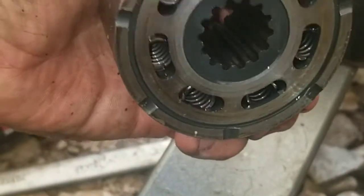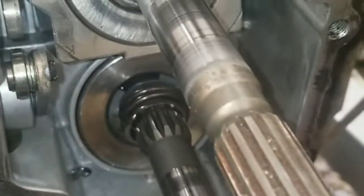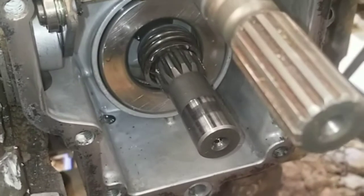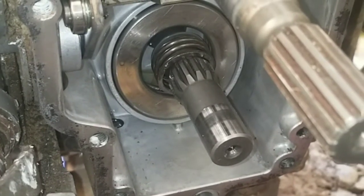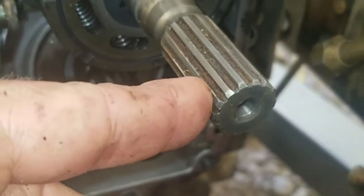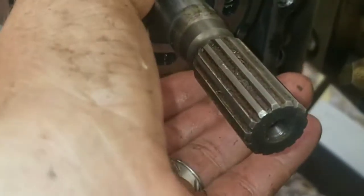It has seven pistons that are spring-loaded as well, and it rides on the top against this plate here. By pushing the pedal forward or reverse, it angles the plate. Right now the plate is angled up — I believe that's the forward position. Neutral would be parallel, so that none of the pistons would be depressed. The piston assembly is toothed to the shaft, which is continuously linked to the motor and is always in motion.